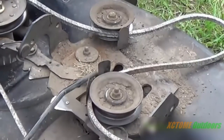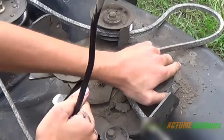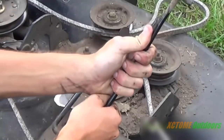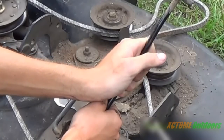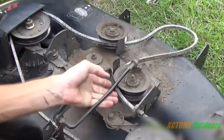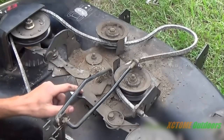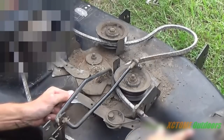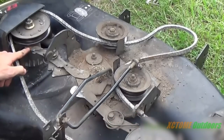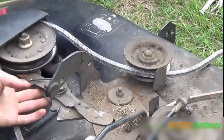I'm going to engage it. This pulley is supposed to disengage to about right here. You engage it, and it's whirring and cutting. When you disengage it — I'm also going to grease this — it's supposed to close these bands to right about there, and there's a stopper there. If you disengage it and that stopper is gone, it's going to shred the belt and throw it off because it's touching this arm right here. That is common on these older-style decks. Also check the bands — these look fairly new, but I can see where the spindle pulley has been cutting into that band, which is about eight-thousandths through.